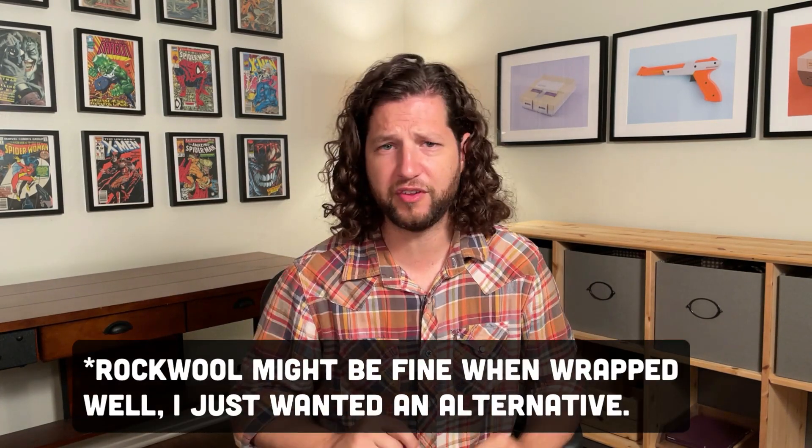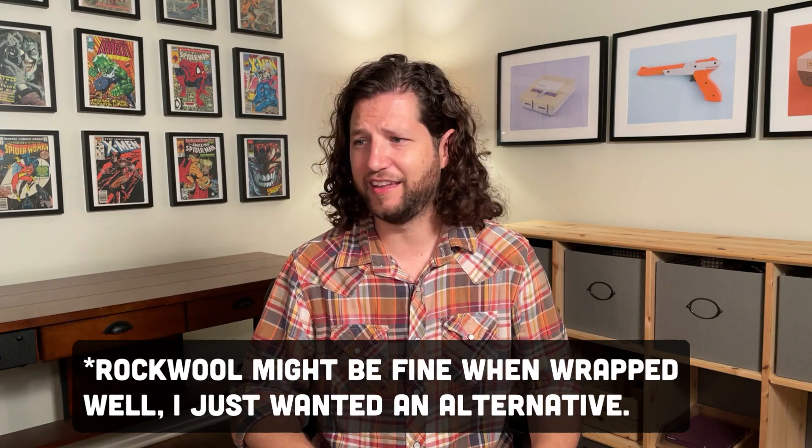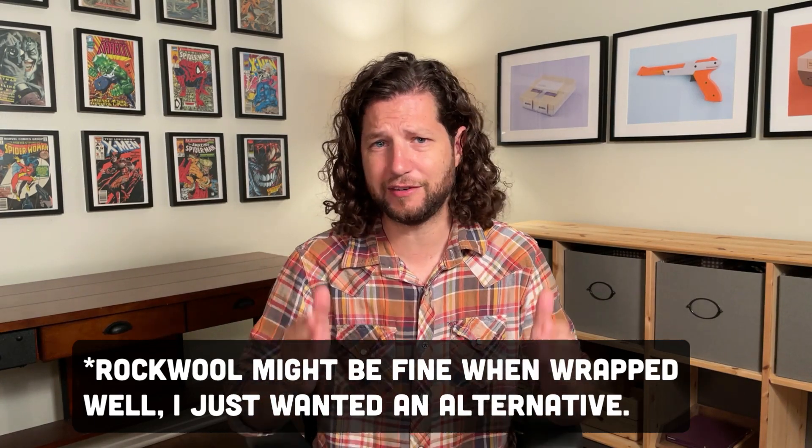Now in your house for insulation, you have either fiberglass or rock wool. In the tutorial I pointed to, this gentleman used rock wool. There's some debate over the safety of rock wool — if I was 100% confident that it was safe, I would have just used it. It's certainly cheaper; you can pick up all the stuff at Lowe's. But whenever you're installing it, they recommend wearing a face mask because those particles can start going around and you can start breathing them. I'm going to be sitting in this office all the time, so I don't want to be breathing that stuff.